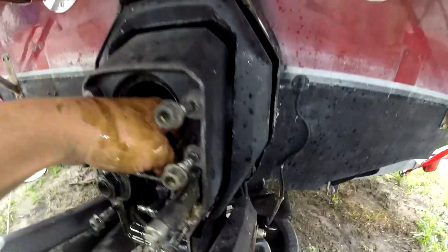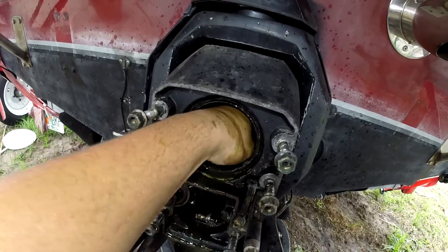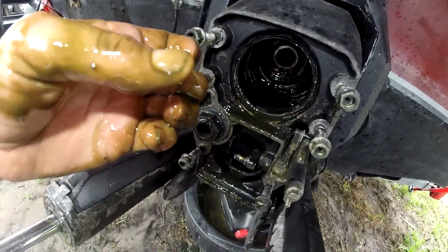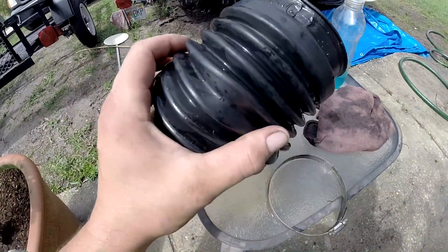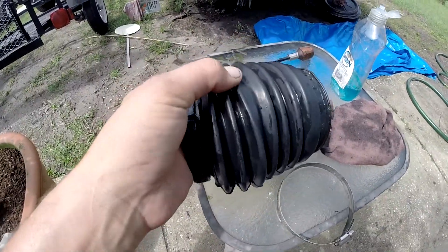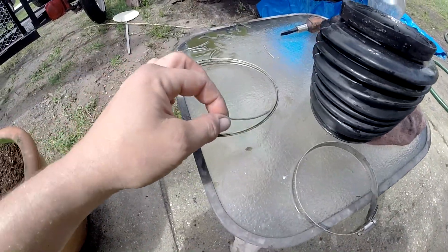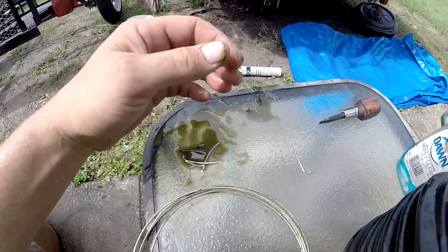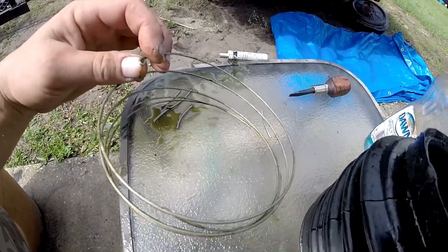There's a deformation in the bellows over here — you can't see it — so I'm going to have to get into this part. I'm glad I caught this because this could potentially sink the boat if I let it go. I took the bellows out, cleaned it up real good, and inspected it for cracks — it looks okay. But the coil inside that keeps it in shape is clearly broken; that's what all those pieces were. It must have been all the way up when someone started the engine, and the universal joint caught and broke it.